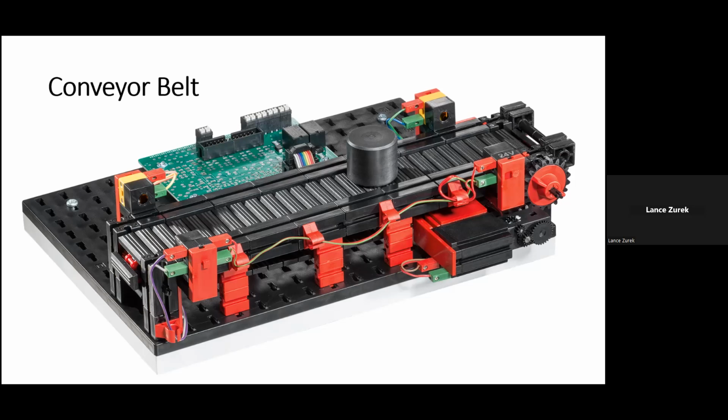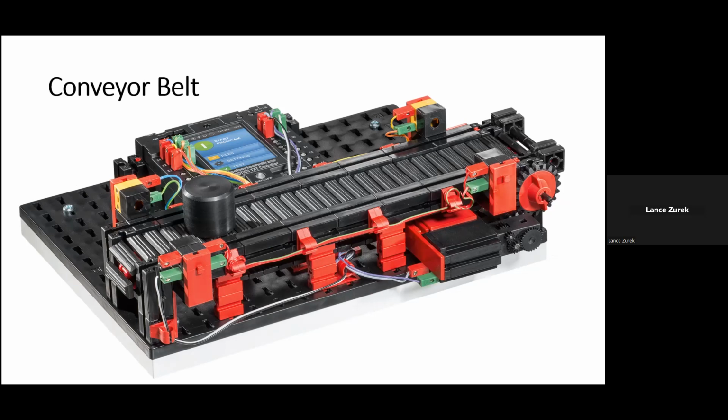And again, the 24-volt version of this model, as well as all but one of the 24-volt versions that we're going to look at this afternoon, will require you to provide the PLC and the program. There is also a 9-volt version, which is connected to a pre-programmed robotics TXT controller as shown here. For this one, a 120-volt power adapter is required for operation.